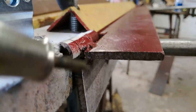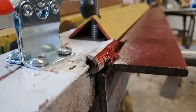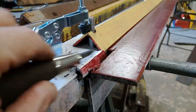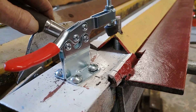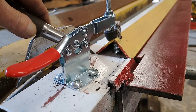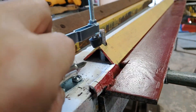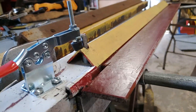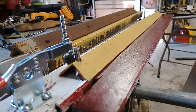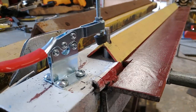Otherwise it's going to be egg shaped when you rotate it — that's the most important part. And one other thing I did on this here: on this part I ground the bottom. Right here I ground this part, because if you don't grind this here flat then your metal is going to get rounded on here. So I just put it on my belt sander and I ground this part — that makes your bend a lot crisper. If you want a radius, just leave this here.